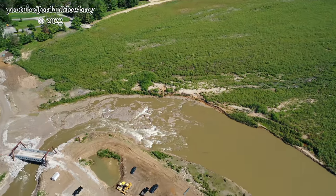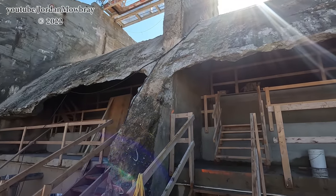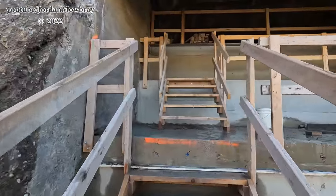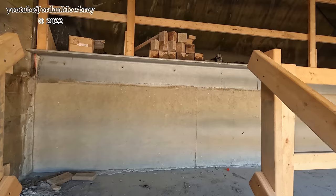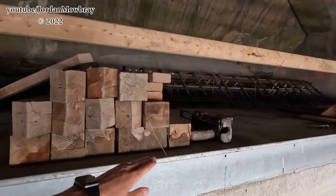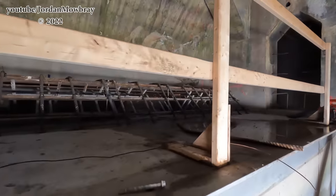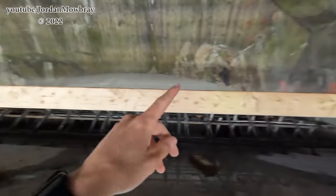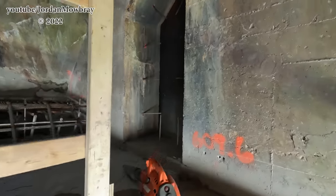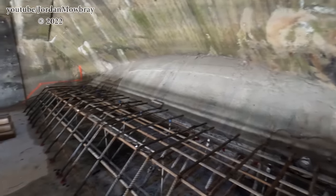Sanford Falls is now entering the center of the screen. Here's what the exterior of the dam currently looks like. Going up to take a quick look at Bay 5, which still has another lift to be poured all the way at the top. You can see this ledge that's supposed to keep out the lampreys — see how wide it is so they can't go over the top of the spillways. Right here is where the old catwalks used to span on the inside, the interior of these dams. Here you can see where that final lift will be poured, with a lot of that rebar all tied in now.